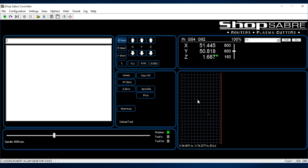This area on screen is actually the machine table itself, and this is where the spindle is on the machine. This area allows me to jog — when I hit that it moves back and forth, moving the machine across the table in all the different axes. I can also move incrementally an inch at a time down to one thousandth at a time, so I can really make precise setup moves.